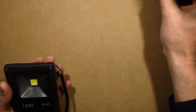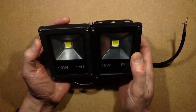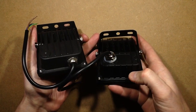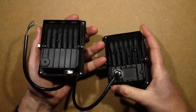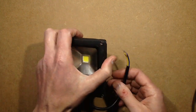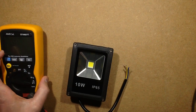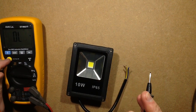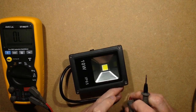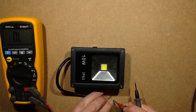There's a bit of foam in the front. Let's compare — it looks fairly similar, a rougher finish I'd say than the other one. They've taken the cable and allowed for a cable gland at the bottom and at the back — that might be so they can add the passive infrared sensor in the bottom. Let's check it and see if it's earthed first, that's usually a good thing to do. I'll put this to continuity and stick one lead on the earth wire, see if I can get a good connection here. They've not bared the end as much — it's the usual very short lead.